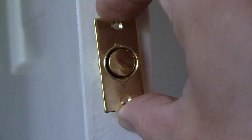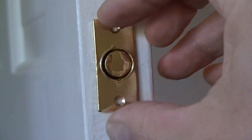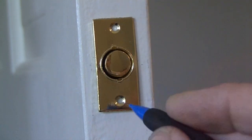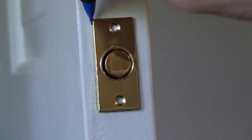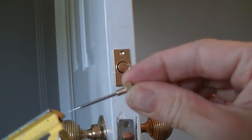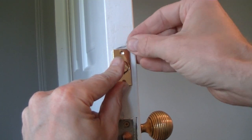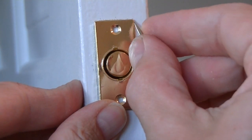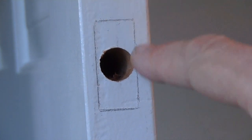You can insert the lock into the door just to check it's moving freely and the diameter of the hole is wide enough. Now I'm going to fully insert the lock into the door, making sure it's level, and mark with a pencil the area that we've got to rebate into the door. The adjustable square comes with a removable bradawl spike — joiners like to use these because it gives you an accurate line but also scores the paintwork, so when you start chiselling you won't damage the surrounding paintwork. Removing that now reveals the area we've got to remove with the chisel.